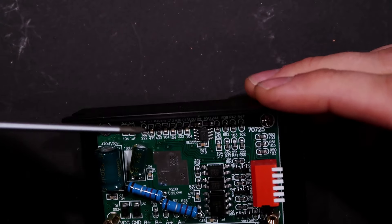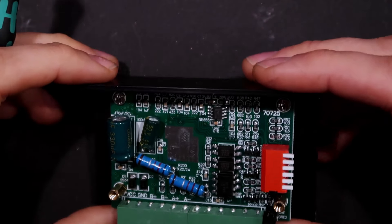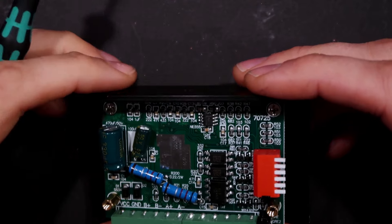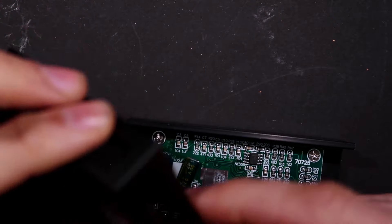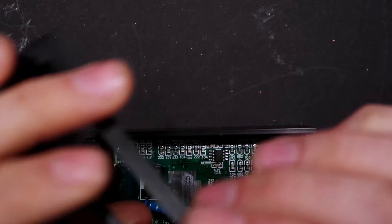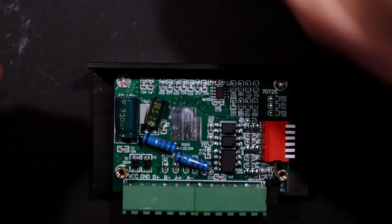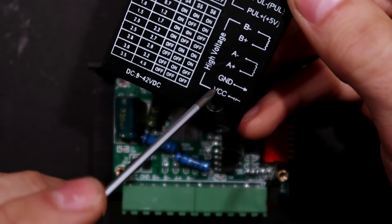There's no conformal coating. If you put this on a 3D printer, okay, not a big deal. But if you put this on a CNC machine that cuts metal, you get metal dust in here — because this cover has holes in it for some reason, despite having a giant heatsink on it. All the dust can go in there and make your electronics unhappy.